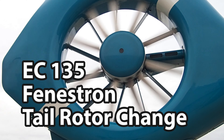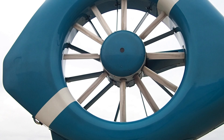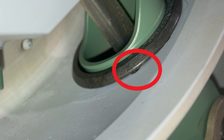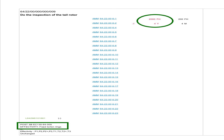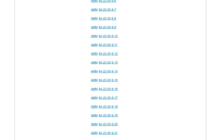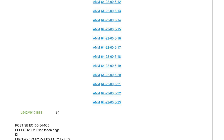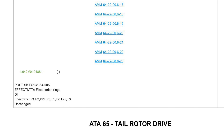In this video we're going to talk about EC-135 tail rotor replacement. There's an inspection — depending on your setup, if you look at the MSM and you have the fixed Torlon rings, the time will be different. There's a service bulletin that came out, so the tail rotor inspection is 2,000 flight hours or four years if you have complied with this SB. If the company sends you a tail rotor assembly and you just slap it on, you might run into some problems — mainly, there's a handful of items that are supposed to be inspected and signed off on this 2,000-hour four-year inspection that are not part of the tail rotor assembly they send you.